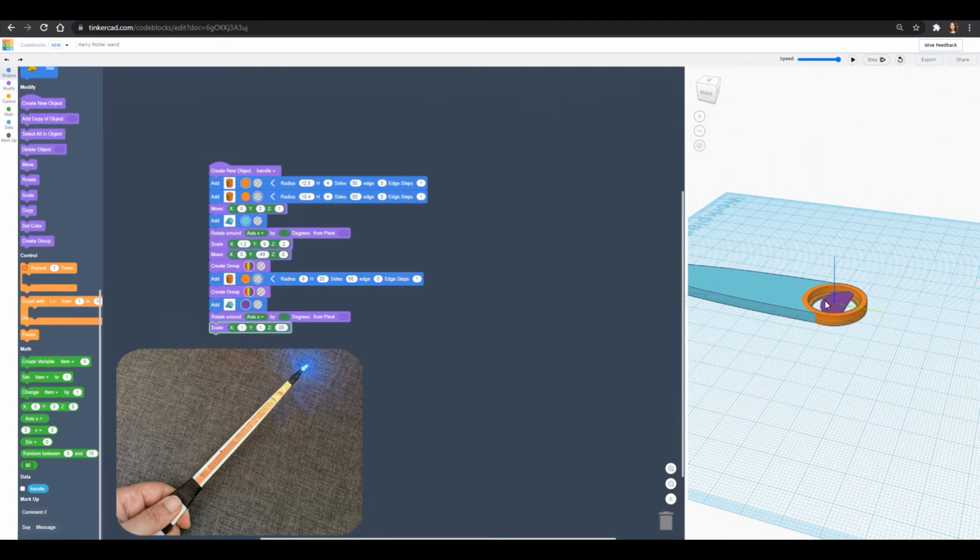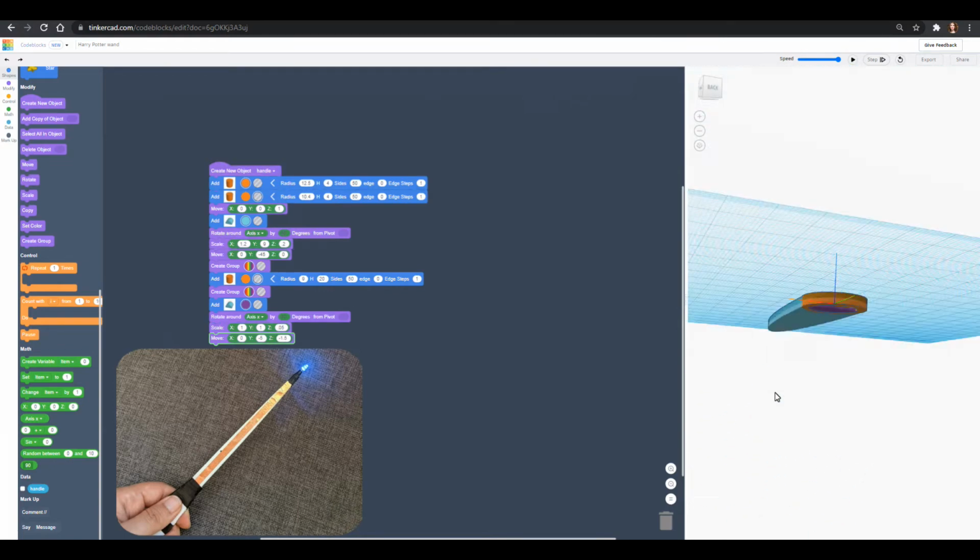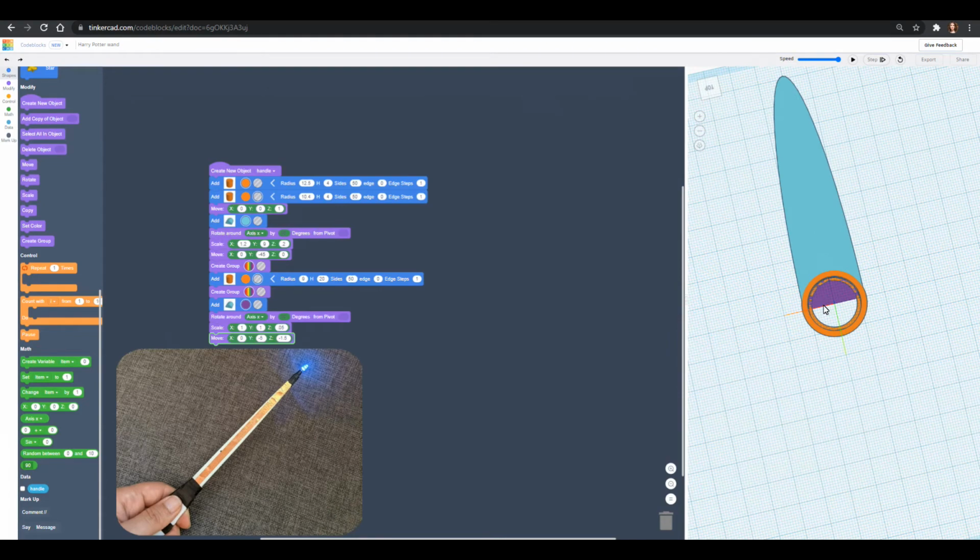We're going to move it down and up at the same time. So come and grab a move item. And we will move it in Y, let's just try by -5, because the negative Y is going up that way, which is slightly confusing sometimes. And let's move it down in Z by -1.5. And that should line it up flush with the bottom. There we go. And so you can see how the copper tape on the back side could come down here and then flip over and make contact with the bottom of that battery.